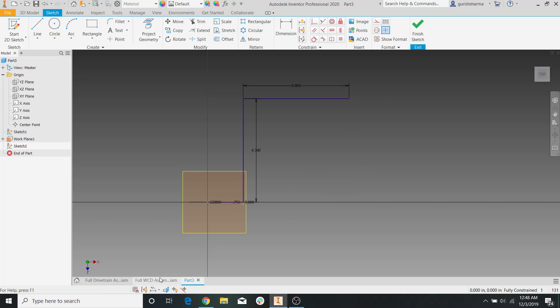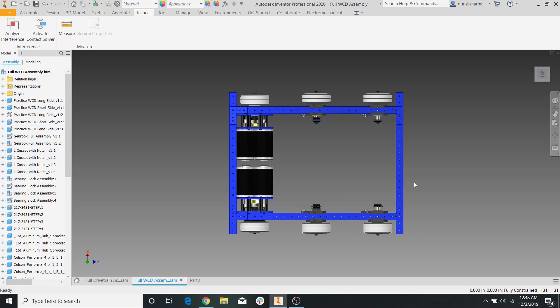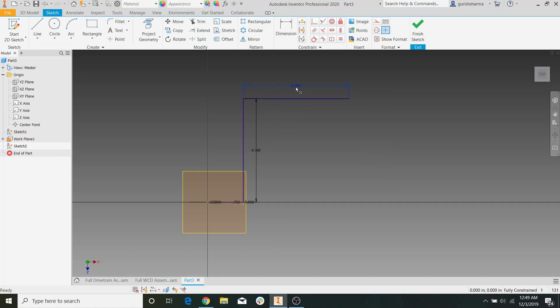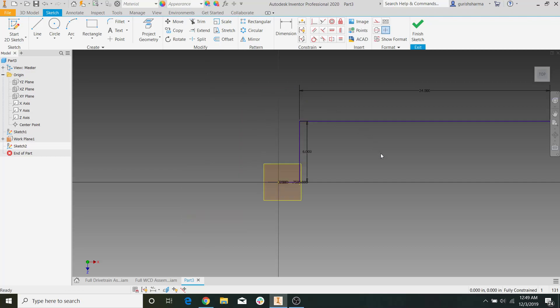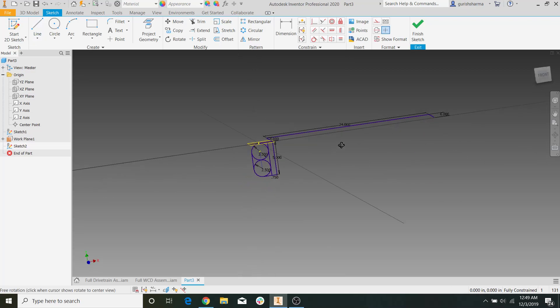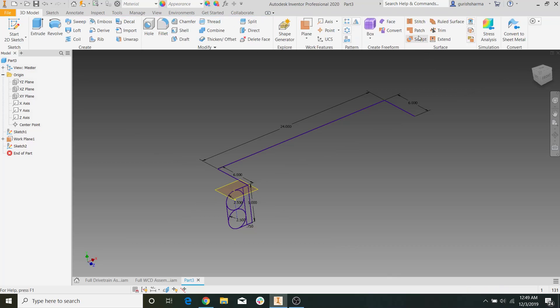But I don't want the minimum. I want something that wraps around — so I want 6 inches on this side, this full length of 24 inches, and then 6 inches on this side. So I'm going to double click on this, make this 24 inches, and then let's add 6 inches to this side. Now you can imagine that if we took this profile and wrapped it around this path, we would get a whole section of bumper.